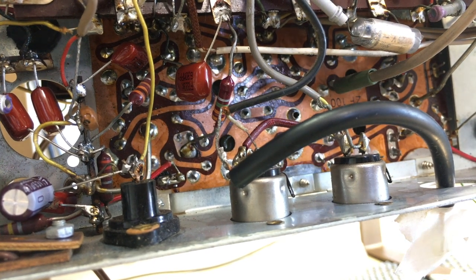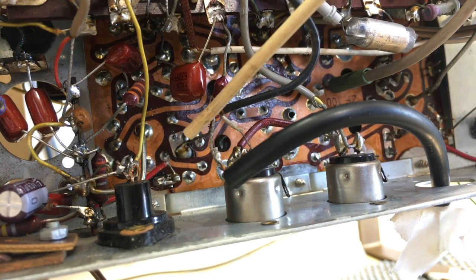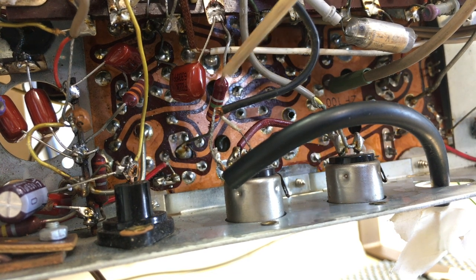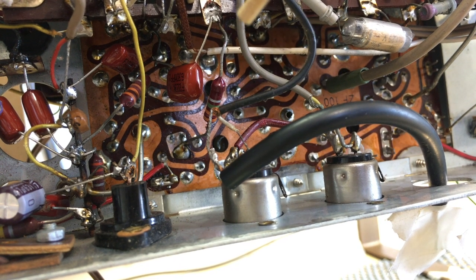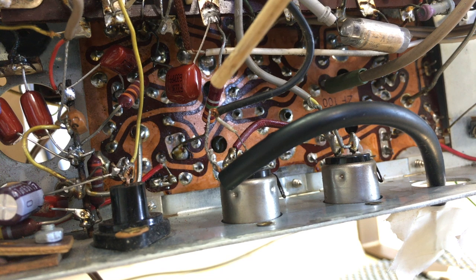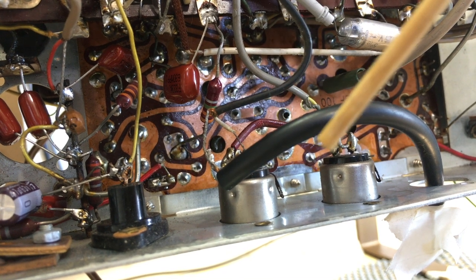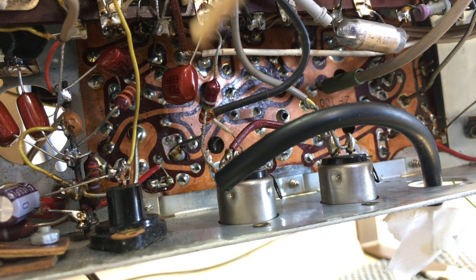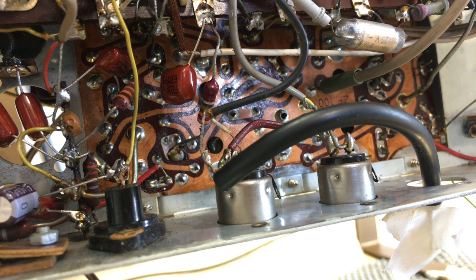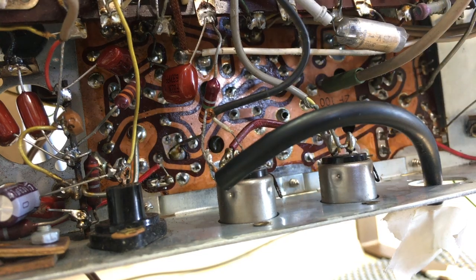I've got the plastic ones, but I actually prefer this thing. This is a kebab stick, because the thread or the hole inside the ferrite core varies quite dramatically. I'm not sure which ones these are. All I do is take a kebab stick and file it down to the approximate shape and see if it works. That means that if I put on too much force, the wood breaks and not the ferrite core. It's worked so far, so I'll do it again.